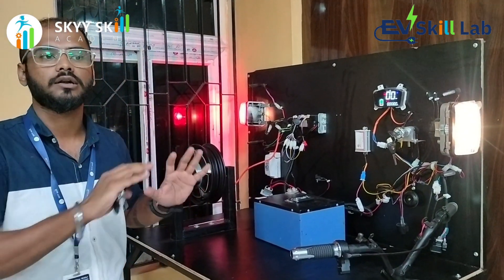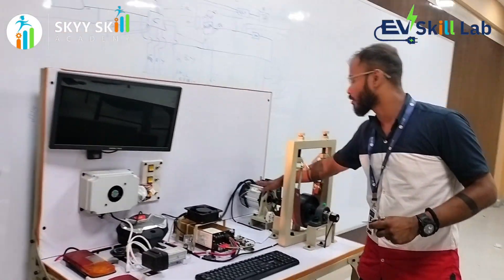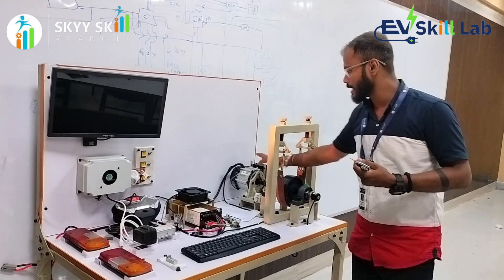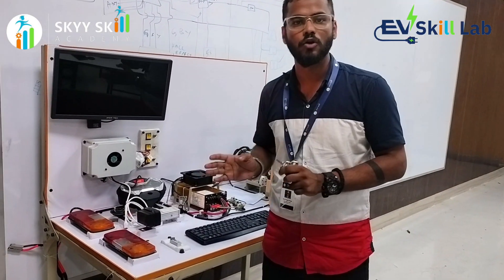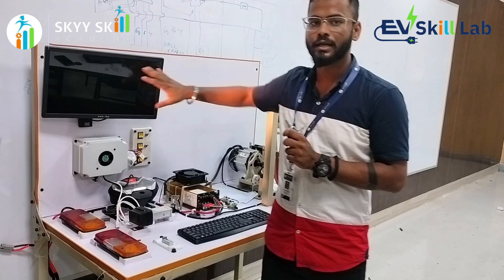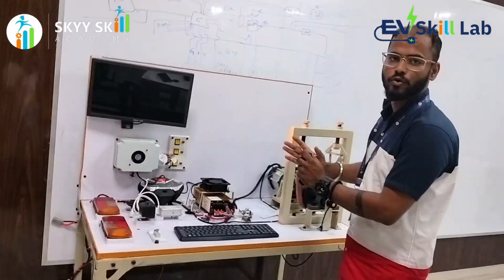The two testings I have shown you allow you to troubleshoot whatever components have any defect. Now we come to the advanced testing. In this testing you can apply loads to the motor — meaning if you want to manufacture a vehicle, you can test what amount of load it can handle. All the data like load, current input/output, and voltage input can be entered into this monitor and the motor will show you the results. This setup is also useful if you are publishing a paper or doing any kind of research.